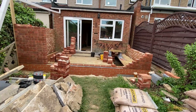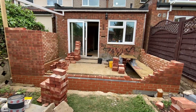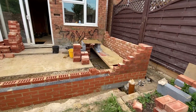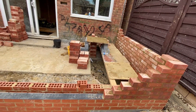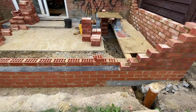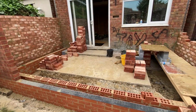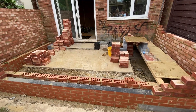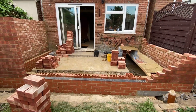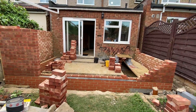If you look closely, that black line runs all the way across to each corner. You can clearly see the difference in the bricks — the very red engineering bricks at the bottom, then the more expensive matching bricks above. They look slightly different at the moment, but that's just an age thing; they mature over time. The key thing here is to have the damp proof membrane in, because that prevents rising damp coming up through the property from the ground. Those engineering bricks repel water — they're very strong with very low water absorption — keeping water at that lower level and not allowing it to penetrate into the house. It's really important that the damp proof membrane goes in at this stage, because it's very difficult to retrofit once the project is finished.